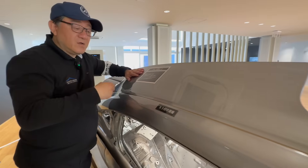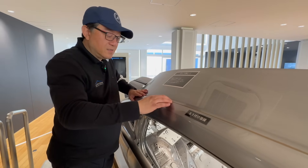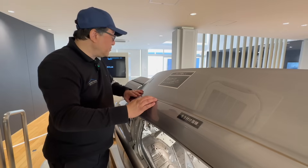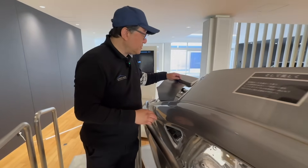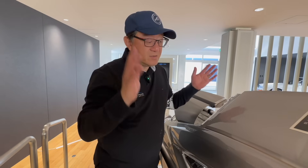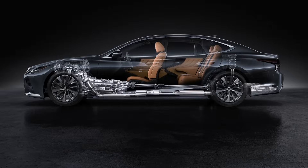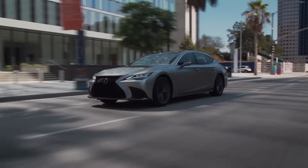The bronze is melted and literally laid across the seam, then they use multiple stages of grinding and sanding to make it extremely smooth. So we don't end up with that piece of plastic that used to be placed over it — this will be the final finish. You paint it, and it looks like one piece. That's another way to increase structural rigidity while keeping it beautiful.